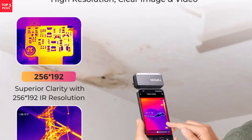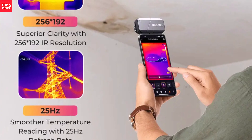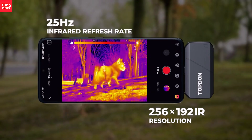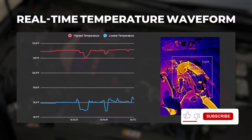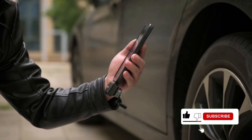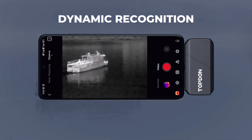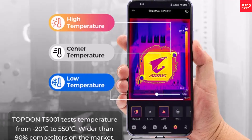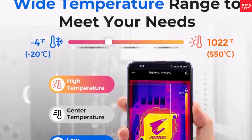The camera captures images at a smooth 25 Hz frame rate and detects temperature ranges from minus 20°C to 550°C (minus 4°F to 1,022°F). Ideal for automotive troubleshooting, HVAC, electrical inspections, or even home repairs. It includes a 50 cm extension cable for added flexibility and is CE certified for quality and reliability.